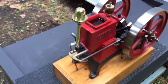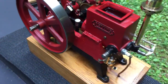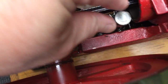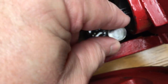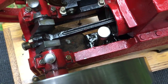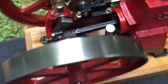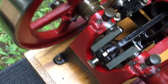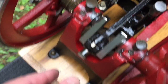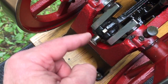This is a real nice running motor, easy to start. The fuel tank is in here — I'm running Coleman fuel with some model aviation castor oil mixed in with it. It's got grease cups on it, using some synthetic grease in there. You turn the caps in and you can see the grease coming out around the fittings.